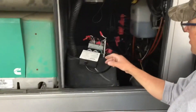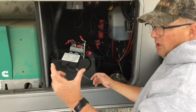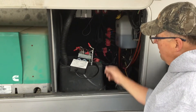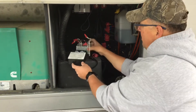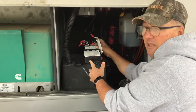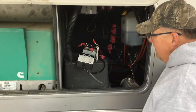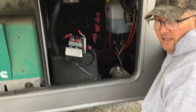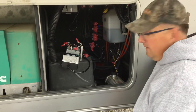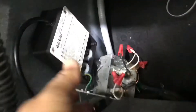To put the new switch on, the runs they put on there for the electrical cabling are probably about that long, and it was really hard to maneuver it up in that space. So what I did was disconnect the work box and another little wiring harness to give myself more space to work. Now all we're going to do is tighten up the hot in and then the 120-volt hot out, then mount everything back up.